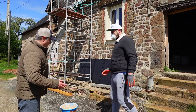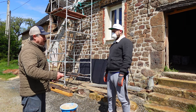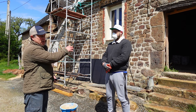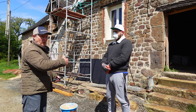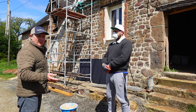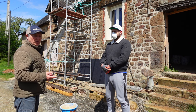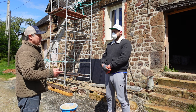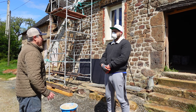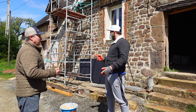Normally what we'd do is put some dry sand in and dry lime powder - not wet at that stage - and thoroughly mix it all together. Normally I've got a stash of dry sand inside, but because I planned to dig out the floor I've taken it out, so we're going to have to use wet sand. It won't matter too much for the volume we're going to use. We're using a one and two and a half mix - one lime and two and a half sand - so grab yourself a shovel and I'll locate the lime.